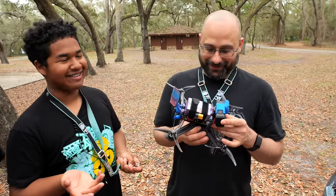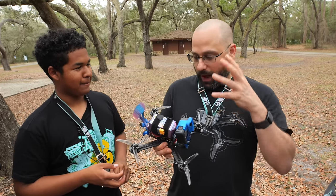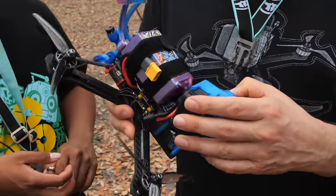What ESC you got in here, buddy? I got the T-Motor F60 amp, and funnily enough, it's 20 by 20. That's the only 8S ESC I can find. It just looks weird. Here's the thing, though. You've got higher volts, 33 volts. As long as the FETs can take the high voltage, I mean...